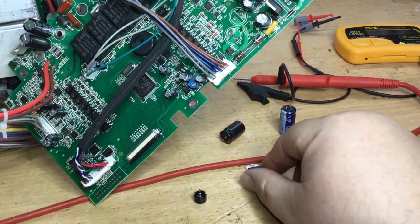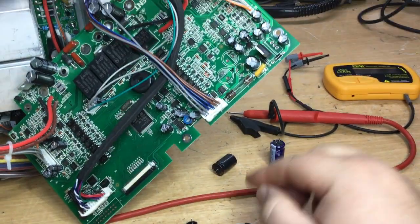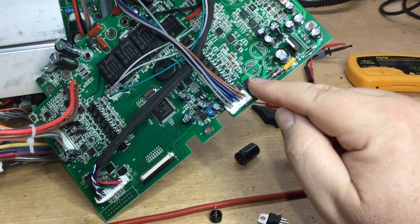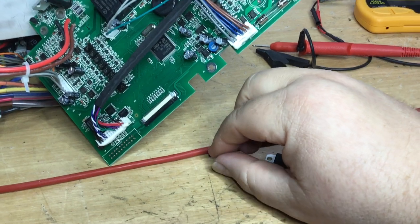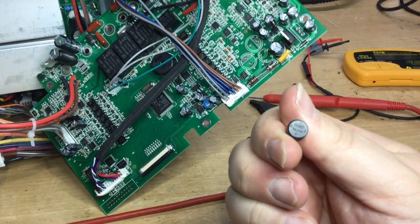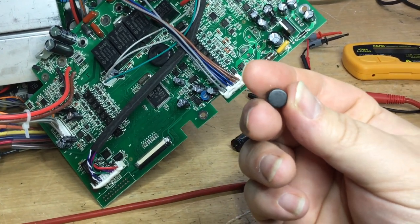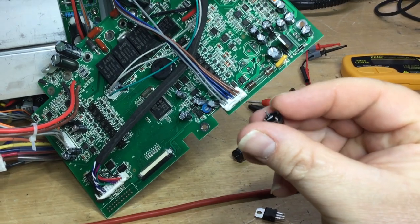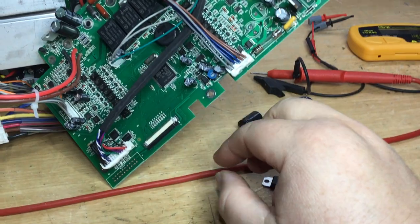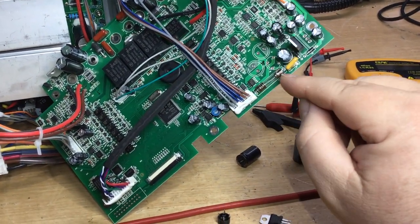But anyway, I've had the voltage regulators out. This is an L7915CV voltage regulator, and that's an L7815CV. Basically, the bridge rectifier as well, I did check that just in case one of the diodes have gone short, thus potentially putting AC component onto the DC rails on the output, but that's okay. All the four diodes in there all check correct on the meter, so it's not the bridge rectifier that's at fault. We can see with the arrangement, we've got an AC fuse here.